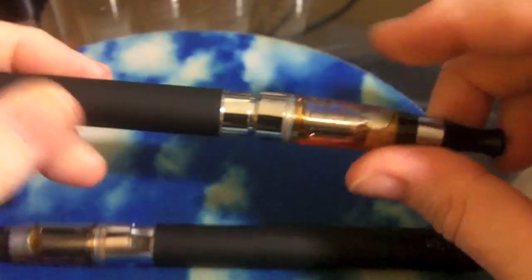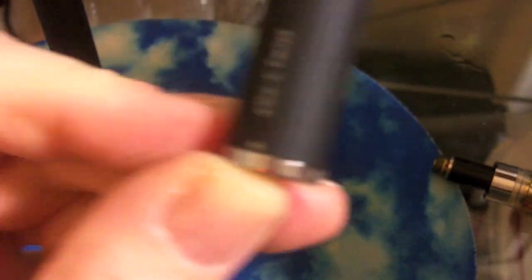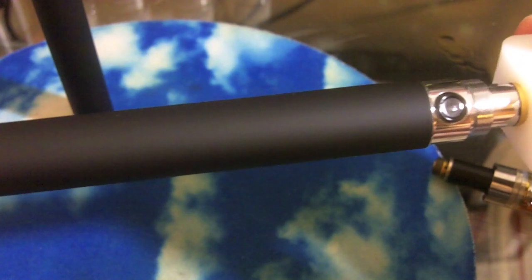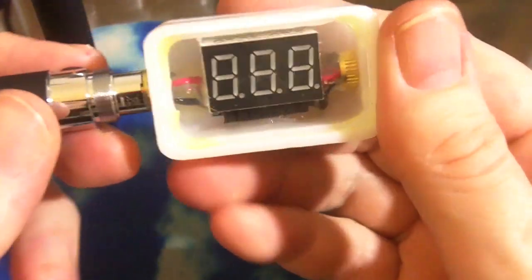Not the best variable voltage ever, but I pretty much use them with these little vision cartomizers — great pocket light thing to use. The very fact that I can use this little voltmeter with it pretty much tells you that they're not using pulse width modulation. I've got it set at a little higher than 3.2 and we get 3.3 — about right. Let me roll it up a little bit near 4 and see what we get: 4.04, pretty accurate. Up to the top — 4.8. 4.8. Perfect.